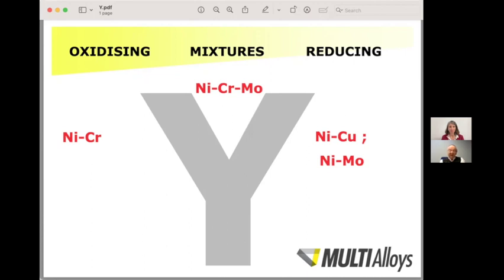And for highly alloyed stainless steels, which we haven't covered in this series of talks, it can get up to about 51, 52. For nickel alloys, it can get up to 70 or 75, which means that just by being able to put more alloying elements into the material, you can enhance its localized corrosion resistance. And also, of course, as we've illustrated here, you can tailor the alloy to the application so that it can be used in a wide range of environments.